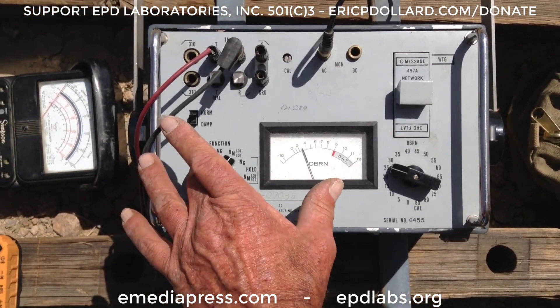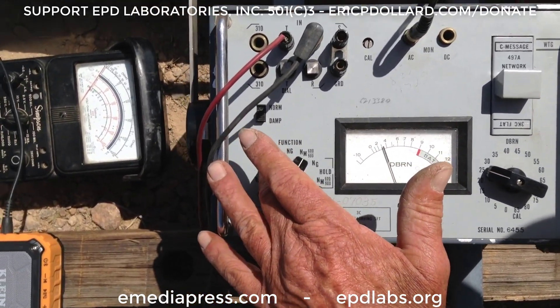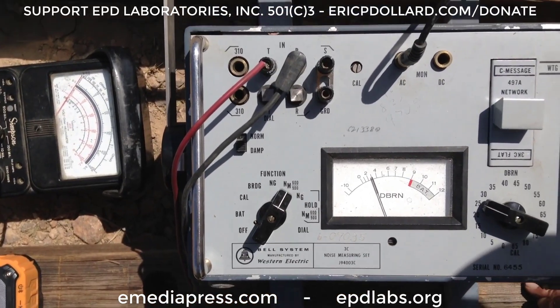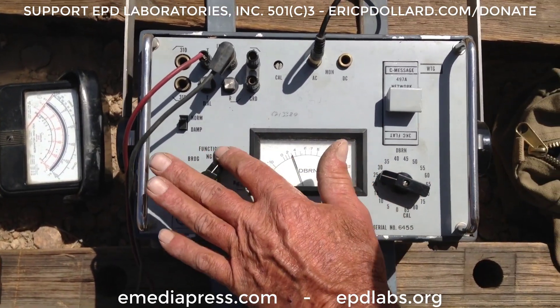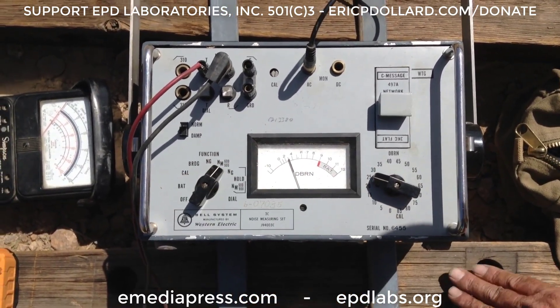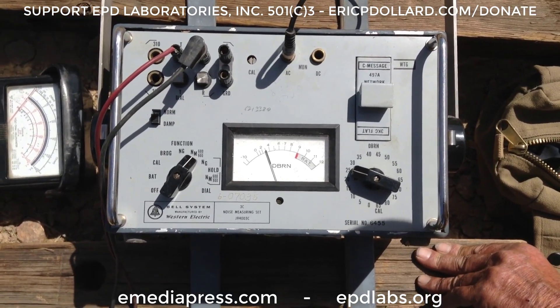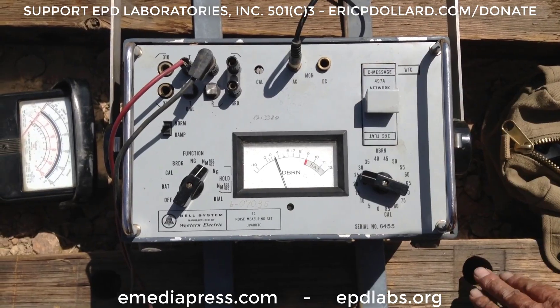In this position it's floating — there's no drain or load on the conductors to ground. And in this one, it puts a 600 ohm or a 900 ohm resistor in. It's a compromise resistor, but it's in that range. So that filters out some of the lower frequency interference and contributes to the filtering of this.